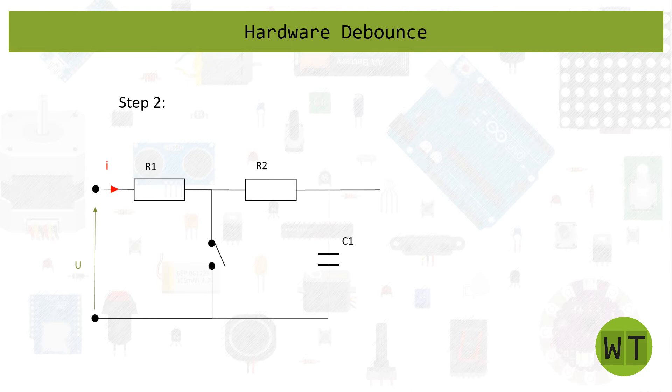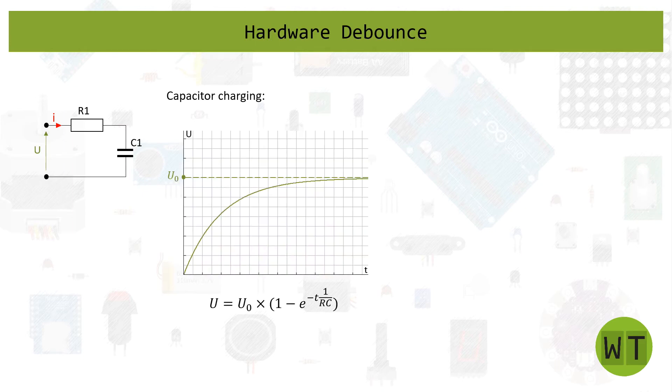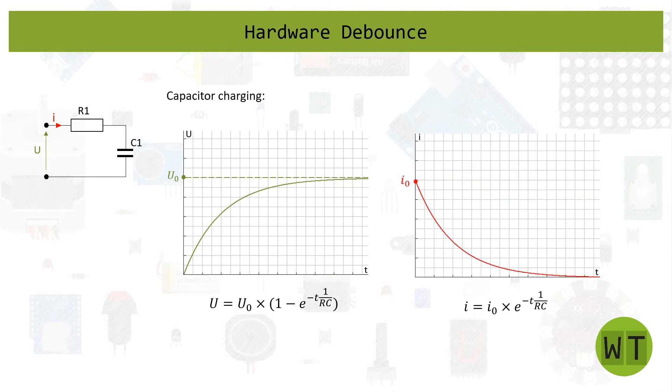Before I show you the result, I want to explain how the RC circuit works. The capacitor in this circuit has two states: the charging state and the discharging state. In the charging state, the capacitor charges energy — the voltage rises and behaves like the green voltage curve shown here. After some time the capacitor fully charges and reaches the same voltage as the supply, and the current drops down until no more current flows. What's important to understand is that the capacitor charges slowly until it's fully charged and then reaches five volts.